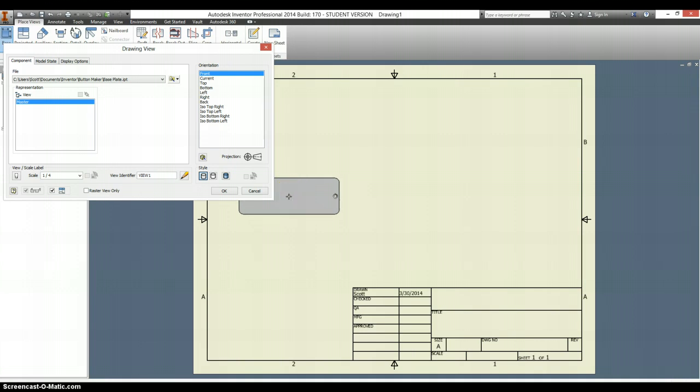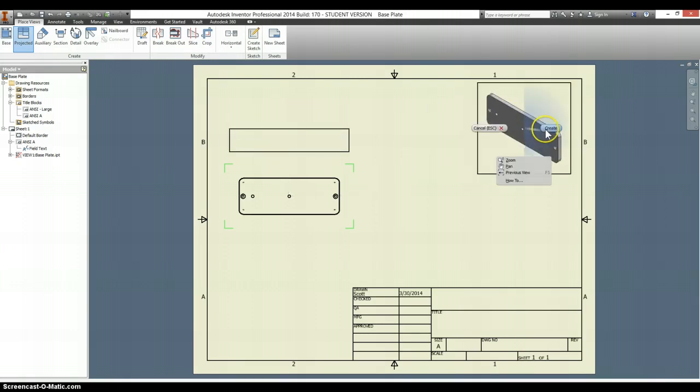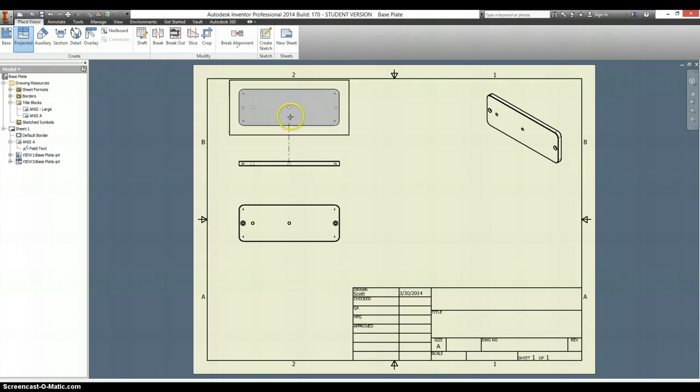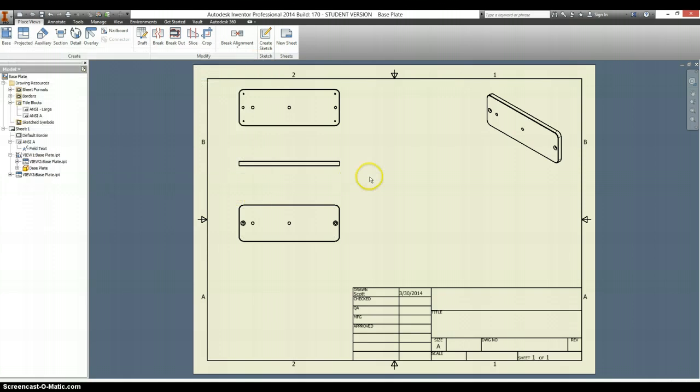It's different on the top and the bottom, so instead of showing the side view right away, I'm going to click in the middle. Now I'll show the top view and isometric view, and I'll drag this both down a little bit. I'll go back up to projected and project that image up again so you can see the difference between the two. And just to make it even more significant, I'm going to take off the hidden lines.